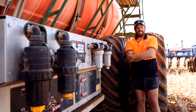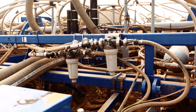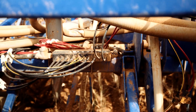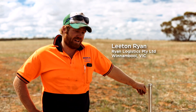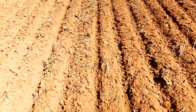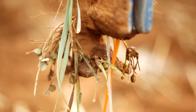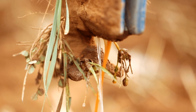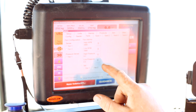I've got a Liquid Systems G22. We've got dual lines, so basically down one line we just put liquid urea, and in the other tank we put our trace elements and calcium and our fungicides. It's very, very precise and very reliable — everything's manufactured to a very high level of quality.